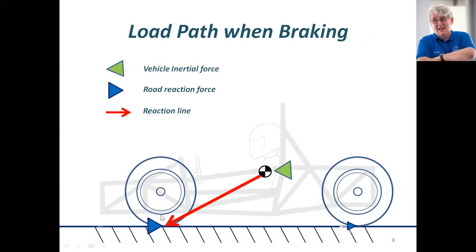It's important to have that picture in your mind and to remember it. You must also remember that there is a smaller, lower-amplitude reaction force — a road reaction force — at the rear tire, but the rear brakes are doing much less effort than the front brakes.